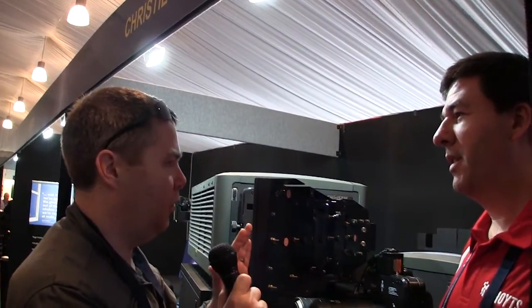It was basically a couple of days of trial and error and fine tweaking to get it to match up perfectly. Now, let's talk about when and why you'd use this solution. For big, big screens and for 3D — that's mainly where you'd use it. Our cinema at Blacktown has a 28.1 meter wide image in scope, and we just couldn't light that up with one projector. With two — we're using two Christie 4230 4K projectors with a 6K lamp in each — at 100% power we can get 16 foot-lamberts across the whole image in 2D. It's a really bright, really spectacular image.